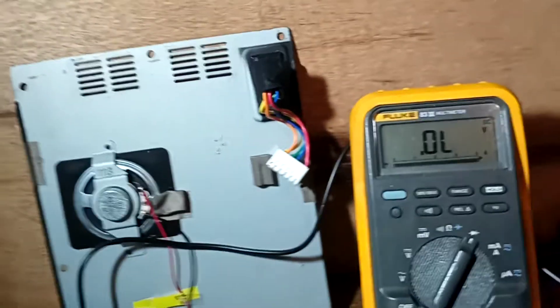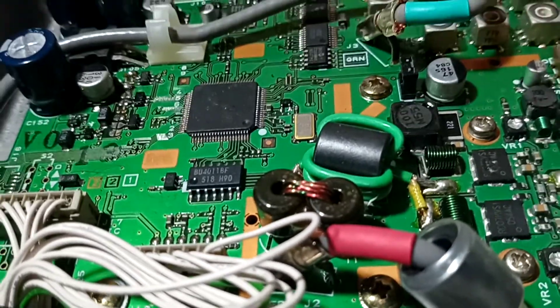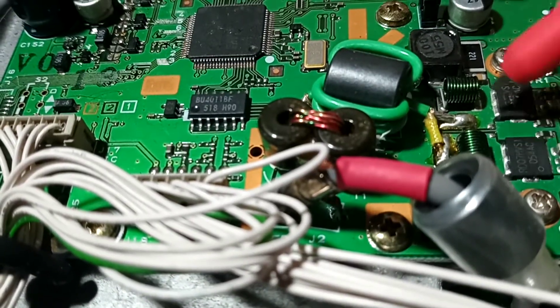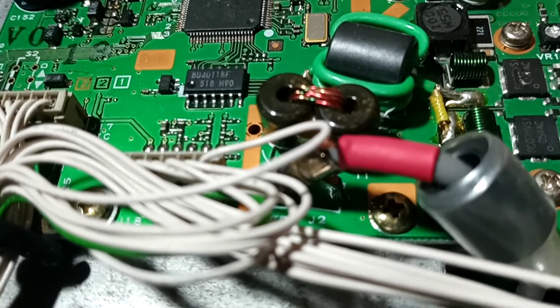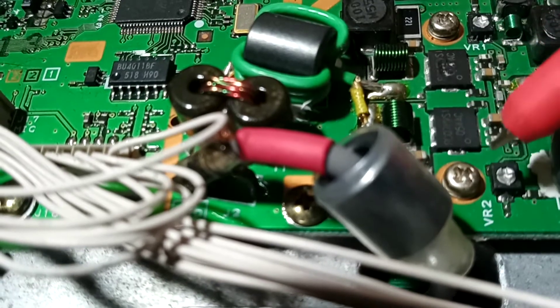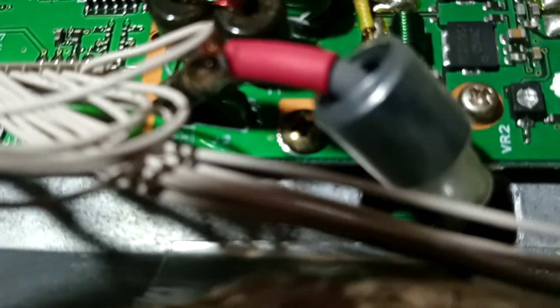So the problem has to be the drivers — or the exciters as they call them — because according to the service manual, there are about two or three small transistors on the underside driving this part of the board. I don't think I've got any of these parts on hand, and apart from that my heat gun isn't here. The underside has a metal plate that needs to come off.